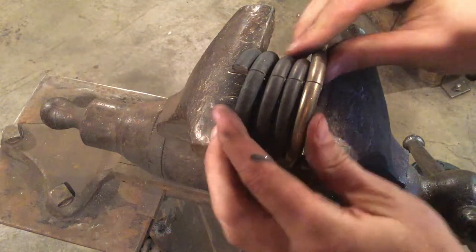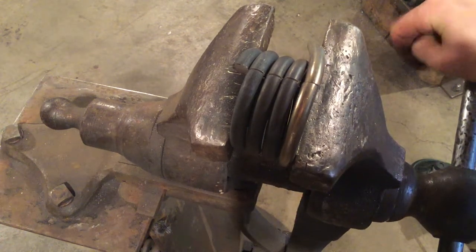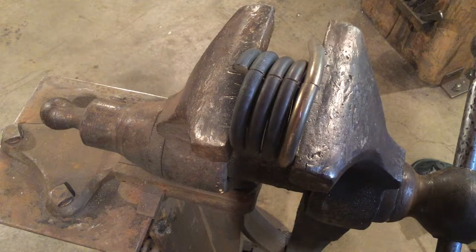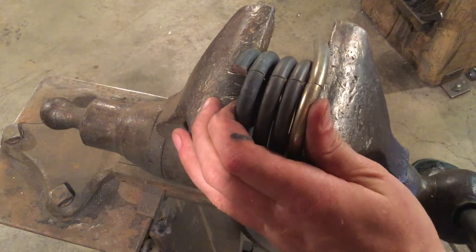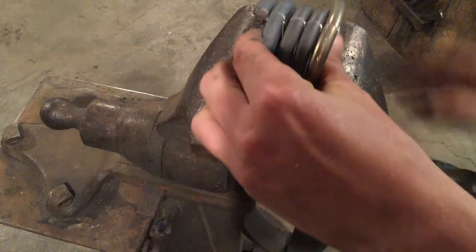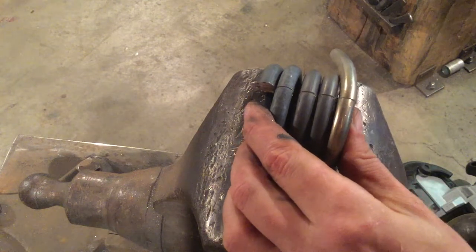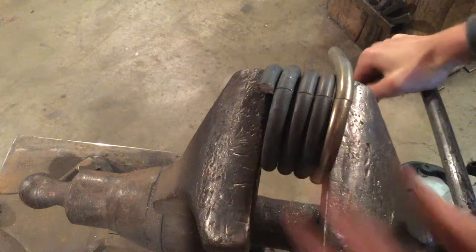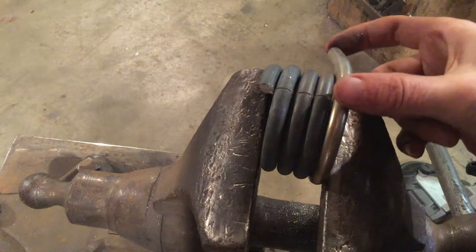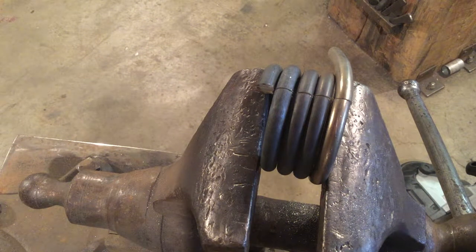You want to let the weight of the blade and the machine do the cutting. If you see that your rings are coming out of compression, take the time to re-compress. This little piece here is loose enough to where it's going to get in the way and bind. So we're going to loosen our clamp, take our piece, bend that out of the way, and clamp just to the other side so that this ring clears our post vise jaw. Then re-clamp firmly, and tap this outer piece of the helix so that the pinch where the cut line is opens back up to receive the horizontal bandsaw.